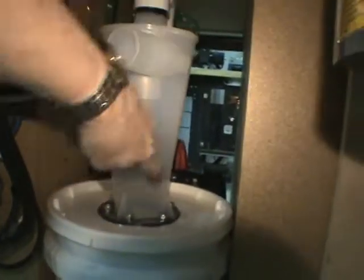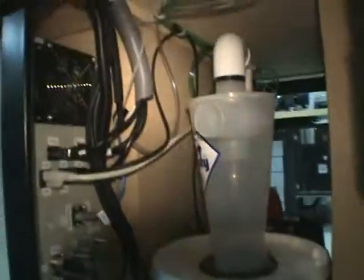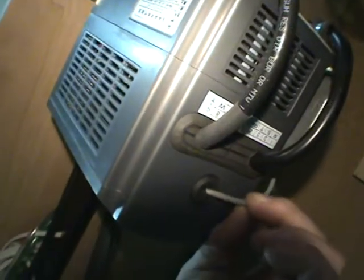You can see the cyclone: sucks in, turbine spins down, drops in the bucket - absolutely no dust in your vacuum cleaner bags; they last a long time. Extra plumbing up top, still not wired in. Monster VFD cable goes into the bottom - that's my programming wire for the RS-485. I'll probably bring manual controls up as well, just because I like having manual control for emergencies.